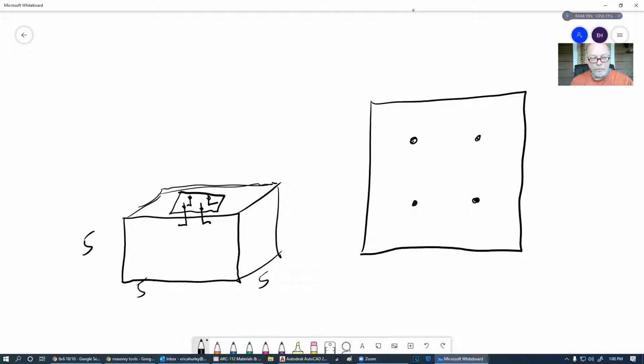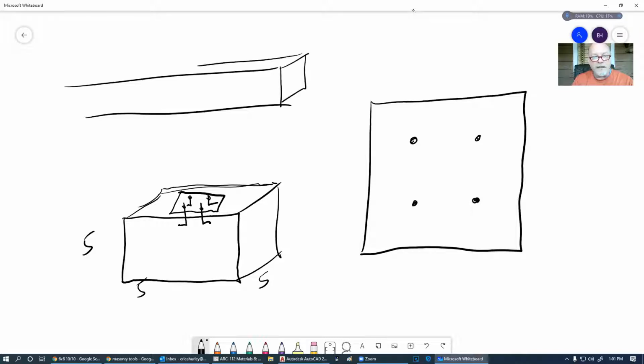You don't want the wood to sink down into it, because the wood's got to come off. We cannot leave any wood in the footings at all, period. A lot of times I've seen in the past, when they do a continuous footing, they will sometimes use wood stakes driven into the ground as a depth meter for your concrete. Well, all wood has to come out. So if you're going to do any type of depth meter in there, it needs to be metal. Most times it is rebar. A 2 foot long piece of rebar driven 1 foot in the ground gives you 1 foot above the ground, and you just leave it. Don't have to worry about it.